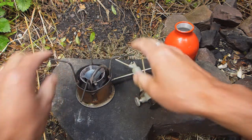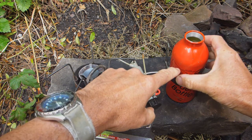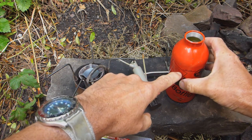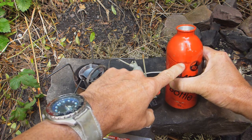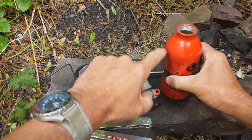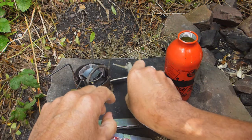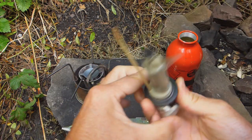So let's get on with it. I've filled this up with some kerosene — sometimes called paraffin. On these bottles there's a fill line, and it's really important for safety not to fill it above that line. There's no necessity to do that. That's the first thing done. Now I'm going to check the o-rings around here.